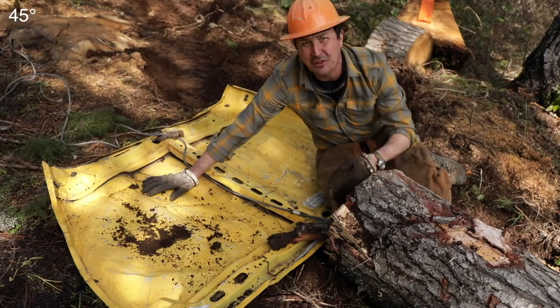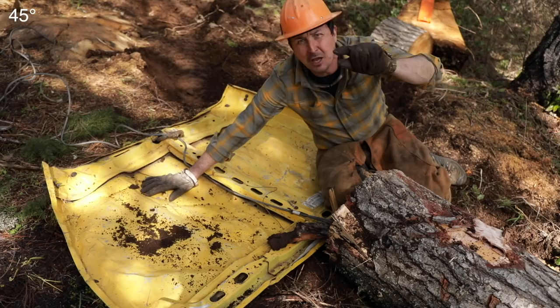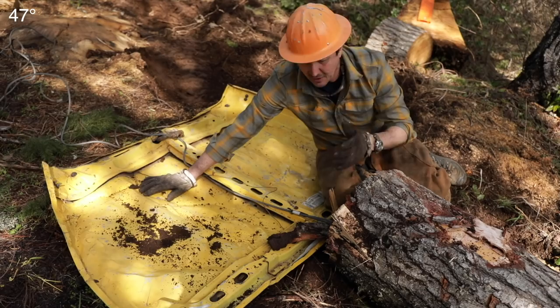You'll see the arch on the back. In the early days, they used to have dozers and a big trailer with an arch on it, and they would run the cable up the arch and go down, and they wanted to lift that up. If you can lift this up a little bit or keep this from digging in the ground, you don't need that much power to pull. You can even pull probably not this big, but some pretty good sized stuff with your truck or with a quad or side by side by getting this up.